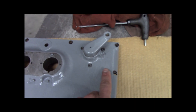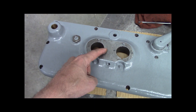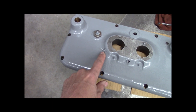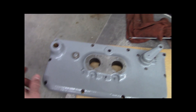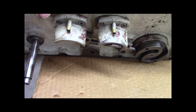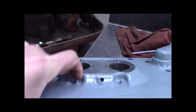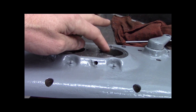There's a Zerk fitting here to lubricate the bushing for the half nuts. This goes into this bore, this goes into that bore. So this Zerk fitting - that one's missing, I gotta get one. These are quarter inch press fit. The brass pipes fill up the oil troughs. These straight-on fittings fill up the oil troughs. These angle ones go to the bores - that angle one I gotta make or find goes to the bores. There's one on that shaft for the gear, and one on the shaft for the hand crank.